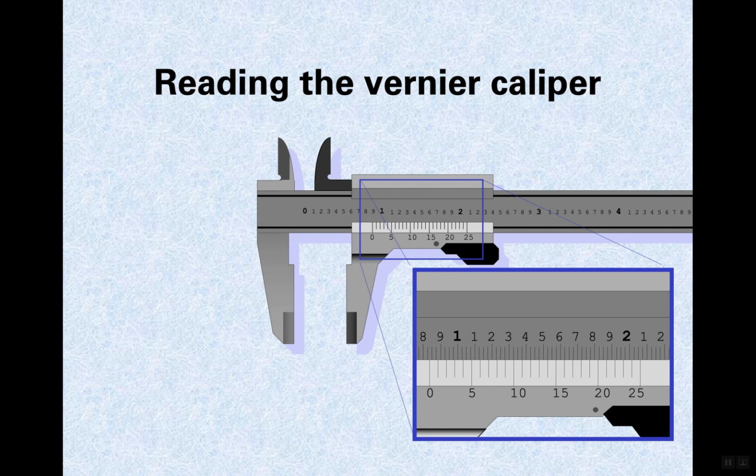Now, I don't know if you remember, if you already watched the micrometer video, but if you look carefully, we have 100 thousandths places here. This is 1 inch, 1.1. So 1 inch, 100 thousandths, 1 inch, 200 thousandths, and that's divided into 4 divisions. Each one of these divisions would be 1/4 of 100 thousandths, which is 25 thousandths.